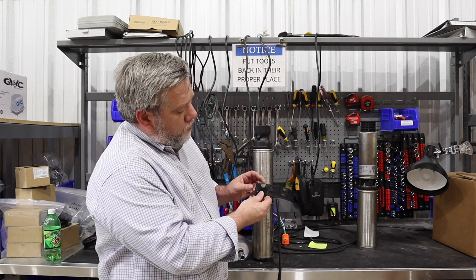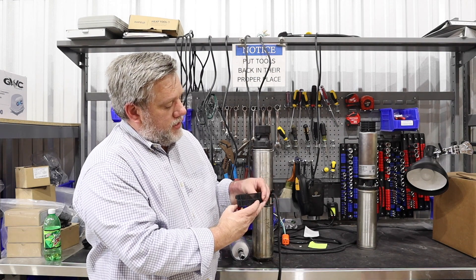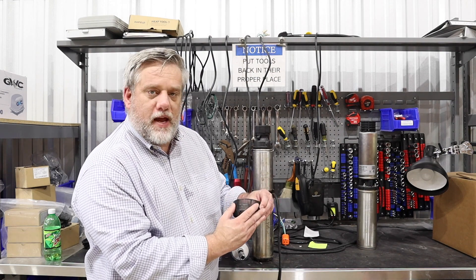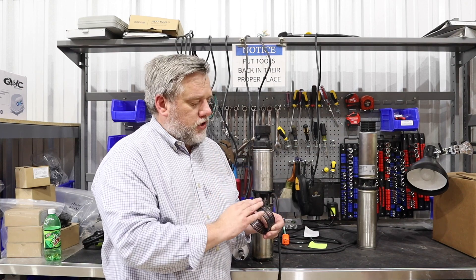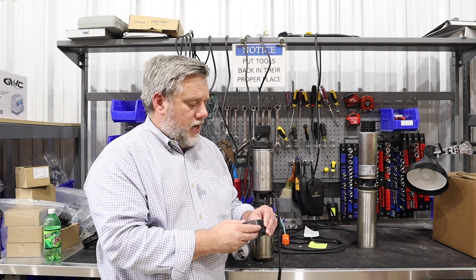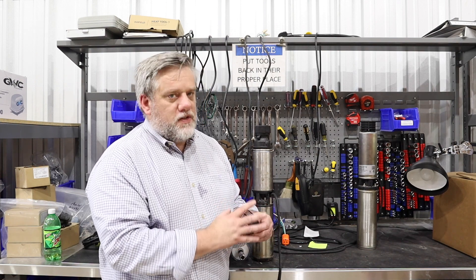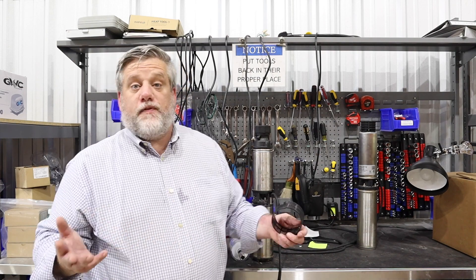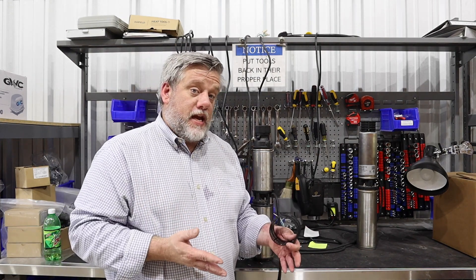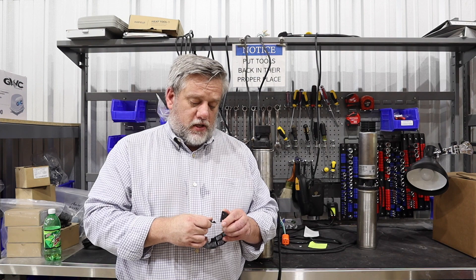The pump is trying to pump water and suck it in through this screen. Generally what we see is this screen is completely clogged. We have a video where we pulled the pump out and showed how it got really dirty and filthy — and if this screen is just completely caked with stuff, you definitely need to clean out. That's a good way to tell if you need to clean out. If it's that dirty in the pump tank, how much dirtier is it in the trash tank and in the aerobic system?